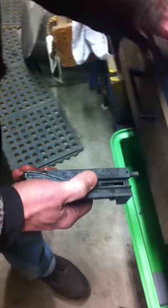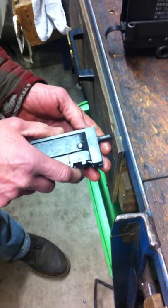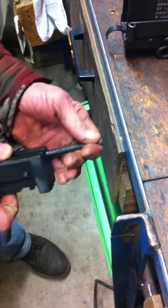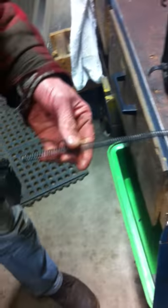Be careful — that driving rod spring has a lot of spring in it and if it flies out it'll hurt you. To get it out, press the bolt up against something and turn the bolt to the left, let the rod start coming out. Grab it when it gets to a certain point and pull it out fast, because you don't want the spring to squirt out the side of the bolt and get all kinked up.